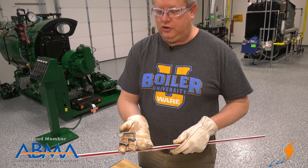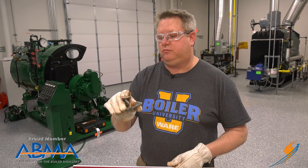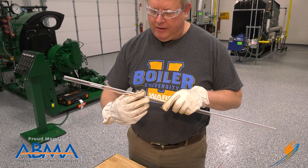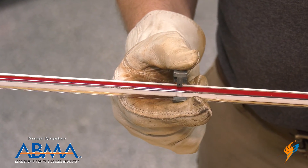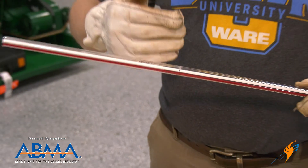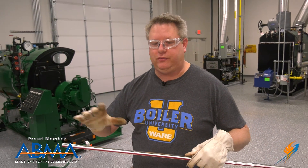This is the cutting tool that we like. There are chain types, but I just have the best luck with this one. Cutting glass is really about confidence and not over-scoring the glass. We want to do a minimum score at our mark — we're basically going to scratch or etch about a quarter-inch mark in the side of the glass. If you over-score the glass and try to go all the way around, you're actually more likely to break it when you snap the glass.